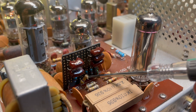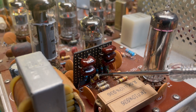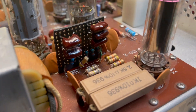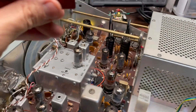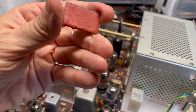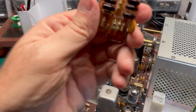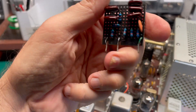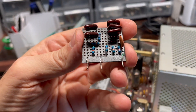That, by the way, is the resistor that needs to be removed to make this thing work. I just lifted one leg because I planned to take this out, put the PEC back in, and stick that resistor back in place. But that resistor needs to come out — that's R325. If you're having sidetone issues, the sidetone's gone out and you've determined it's not the tube or something else in the circuit, it might be this thing. They do go out, and you can build your own. It may look like that, hopefully better than that, but hey, it works. Have fun. 73.